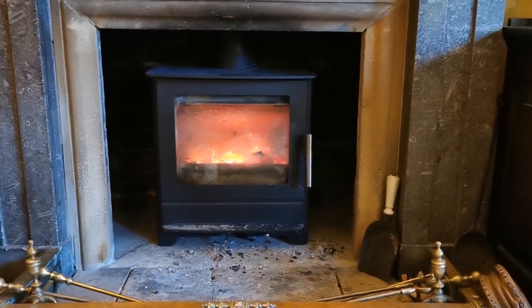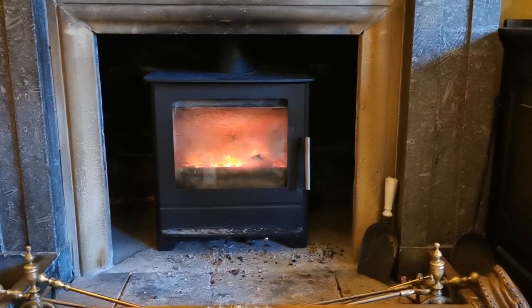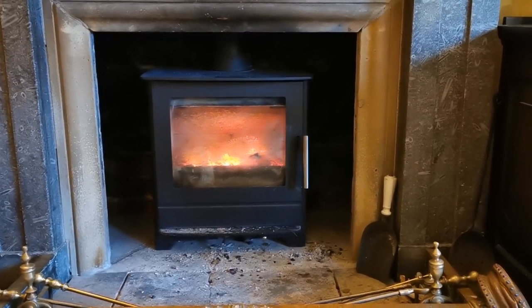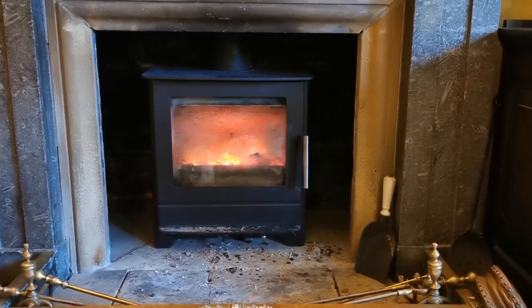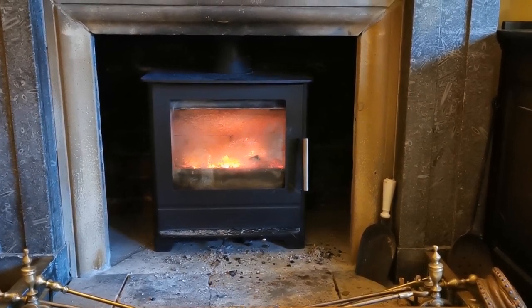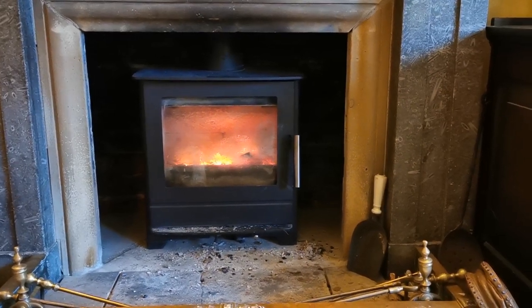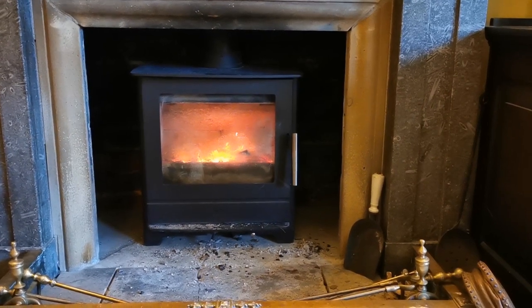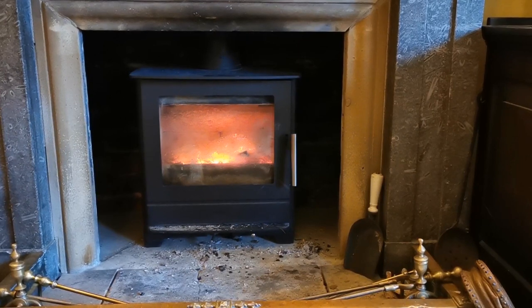It was chosen to come in here and replace an open grated fire that was horrendously inefficient, if beautiful. But it really has transformed the heating in this room. Now, this is sitting at the base of an almost 15 metre Georgian chimney, and the liner was critical here, so it wasn't cheap or easy to install. We also had to have some building work done to create the opening for the log burner. We were restricted by the height, and that really made part of our decision easy for us.